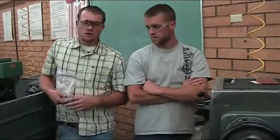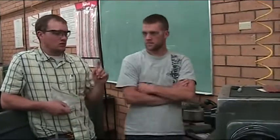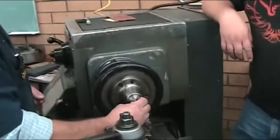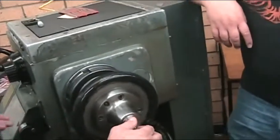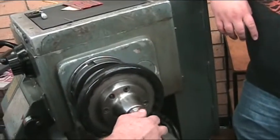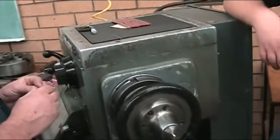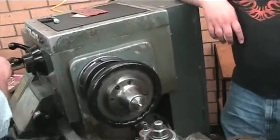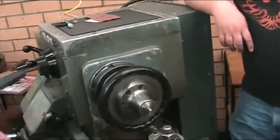I'm going to go see if I can find another one. These threads are so exciting. Yep. Let's see if this wheel's a little tighter. Hopefully it won't even screw on. Okay, that one's a lot better wheel. It doesn't screw on at all. And it shouldn't at 269 because we're still 8 thousandths big, right?